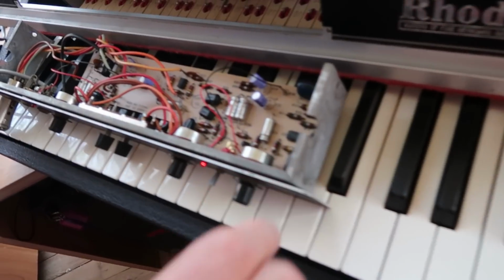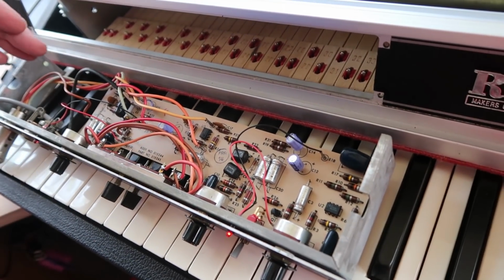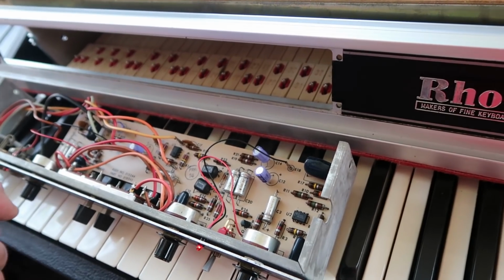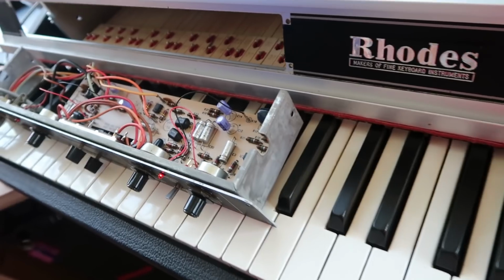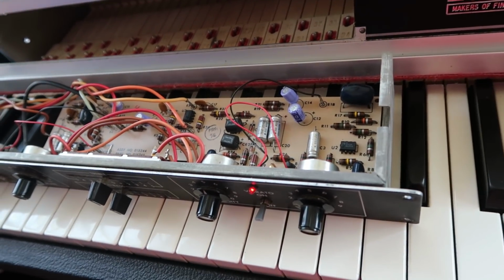It's coming up here, though. Oh yeah, power is coming, and no, the garbage is coming up there. Otherwise, it wouldn't be humming. Oh, garbage is coming from that, you think? Yeah, it has to be. It has to be from the capacitors and the main power supply. So maybe that's what I should be looking at. Well, for the hum, I think. But I can't tell right now.